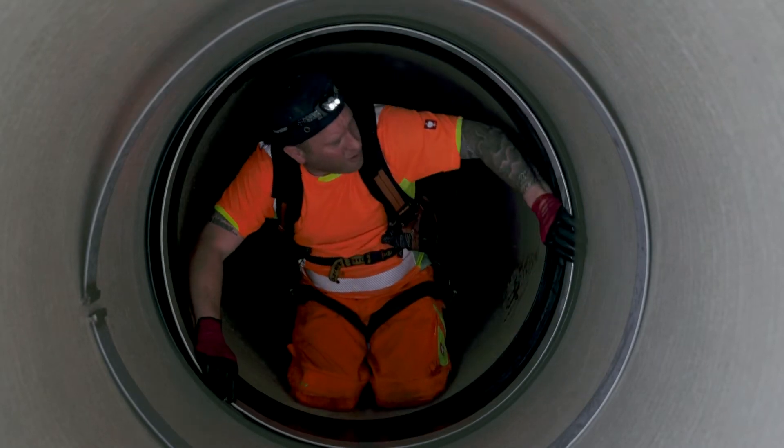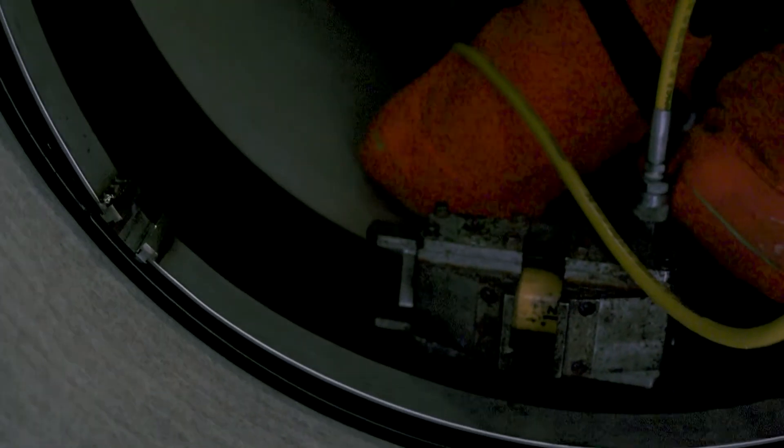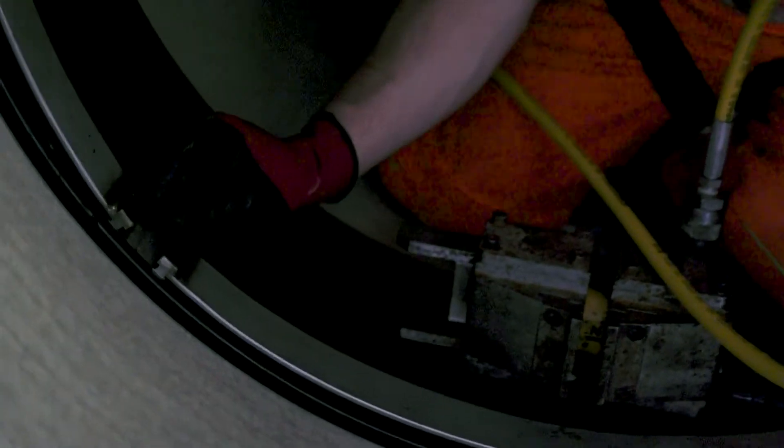To open the ring up and get compression, the shim goes in here, then we put the ring into the groove. We take our AMX expander, which mechanically forces outward from both sides — if you remember, we push like this and it keeps opening. I'll put that into place and start applying force.